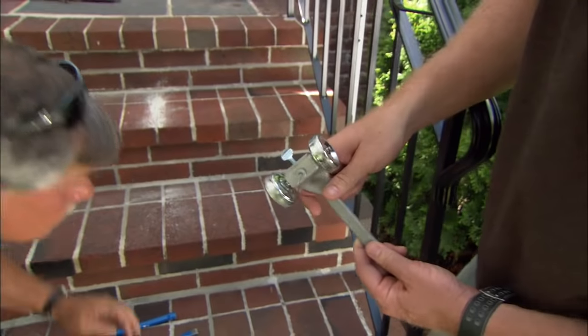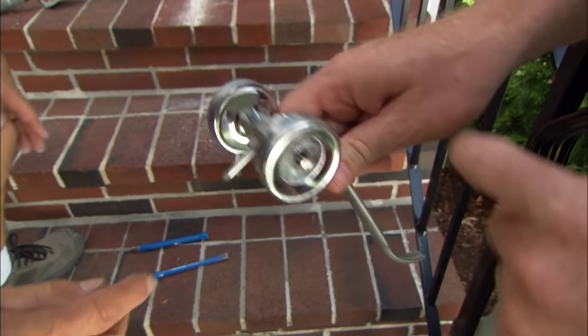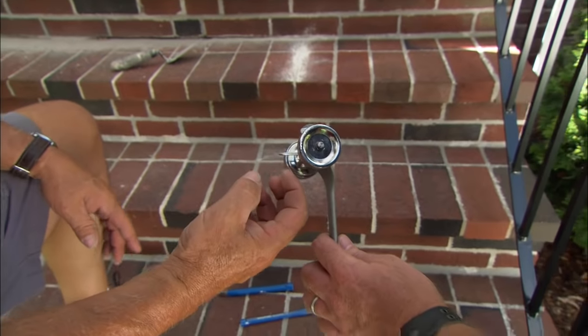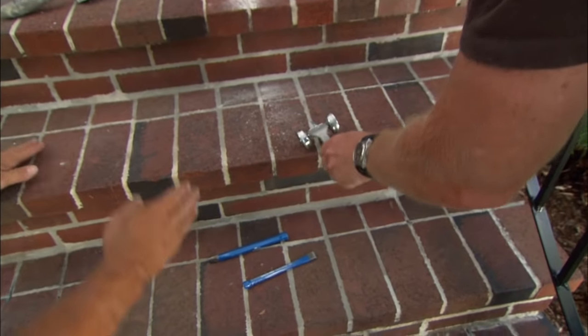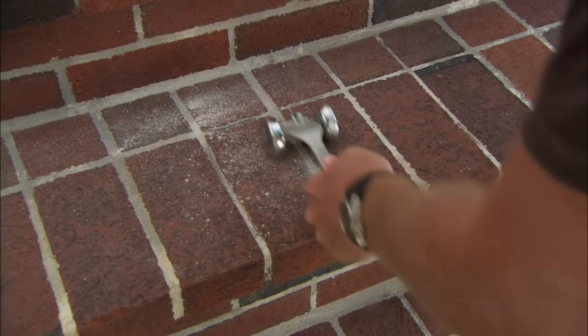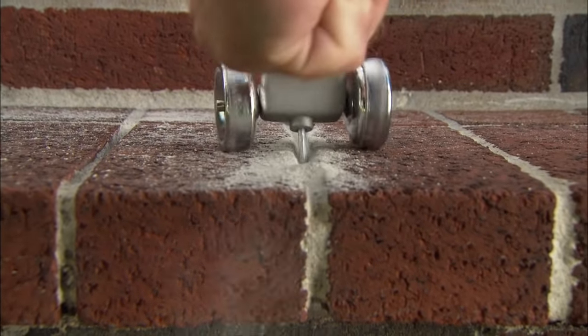So now, what does this tell me? I've never seen this before. You've got a device with a nail sticking down that's adjustable and it rides on two wheels. It's actually a masonry nail — you want something that's really firm. It's actually a gauge that will set the depth, and it's only good if the mortar is really loose. But give it a try. Drag it back and forth. You get it at the right angle and you'll be down wherever the depth of the nail is set.